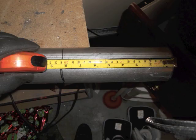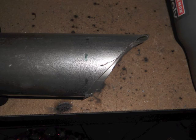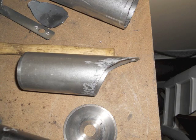Next I'm going to cut the part that's going to attach directly to the combustion chamber. A lot of the dimensions I'm kind of making up, but this one I decided to go with about 8 inches. When you start to work on it yourself, you should be able to get a better idea of the dimensions that you need. So here I decided to cut a 45-degree angle, drew that line, and cut it out with my angle grinder. Then we're going to use the grinder to shave down a bit to make it round enough to fit the 6-inch diameter combustion chamber, and it should look pretty close to this.